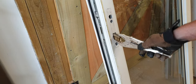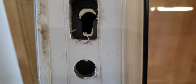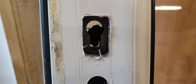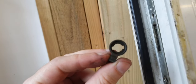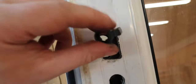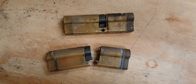There we go. Now you can reach in behind and pull out the rest of the cylinder. Inside there you'll see the cam — just reach in and pull that out. Push about inside and there it is — that's the cam piece. Make sure you get that thing out of there, as sometimes it can drop down and fall further into the lock mechanism. Just make sure you fish it out. And that's how you snap a euro lock cylinder.